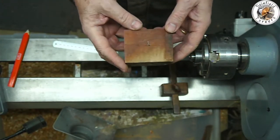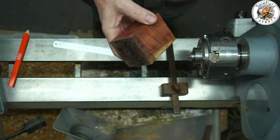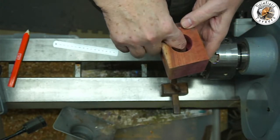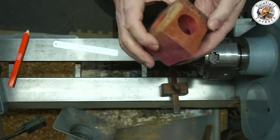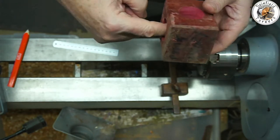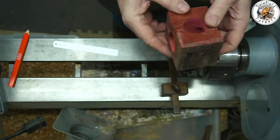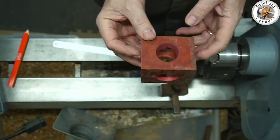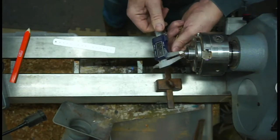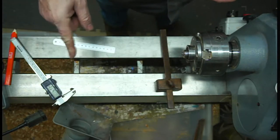I've marked it with my clicker pen marker on all corners and I'm going off to the pillar drill. I've drilled the holes - I had to go all the way through on one side which popped out the bottom with a little bit of ragging. On the other side I had to drill half and half because the Forstner was having difficulty going all the way through due to bounce on the curved inside. Now I'm drilling a small hole at either end to take the finial. A quick measure of the tip of the Crown Step Drive shows it's a five millimetre diameter, so that's the hole size I'll drill either end.